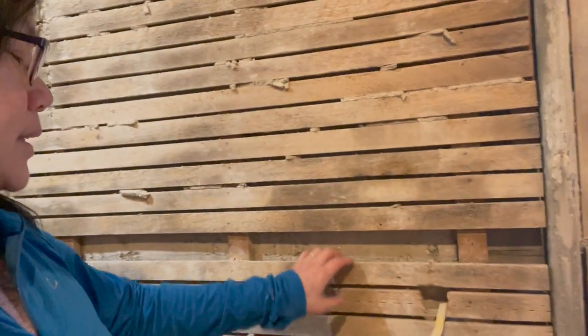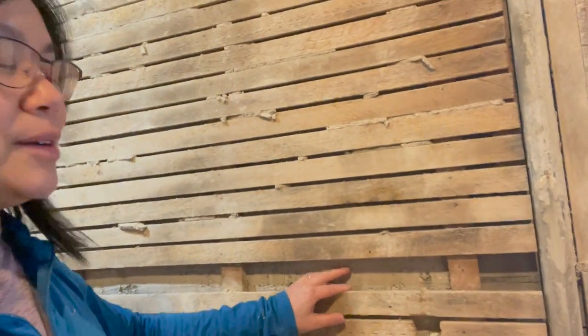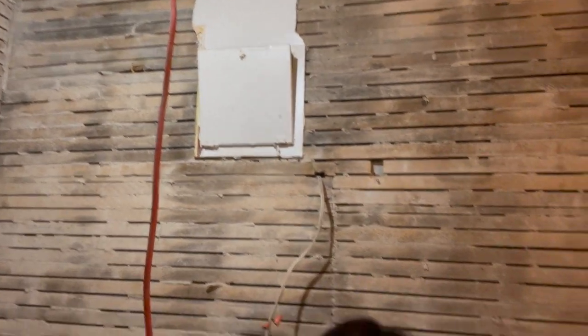This is lath and then double brick construction — one brick, an air gap, and then the exterior brick of the house, which is typical of this era. We're going to open this up and see what's the best way to get some insulation in there. The room is a little cold right now because that fan I showed you earlier is a bit open, so we'll try to tape it up to keep the house warmer. But that's day one — they've done a really great job, worked hard all day. This is what a broom-swept condition workspace looks like at the end of the day. Do your contractors do this?